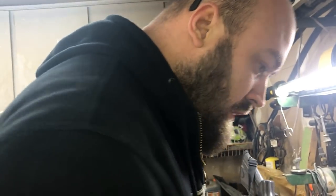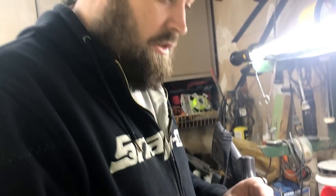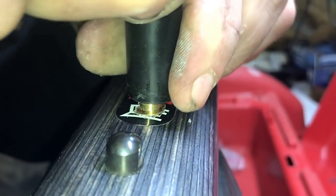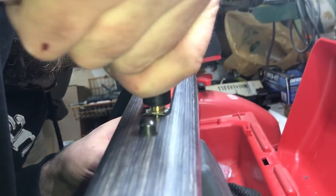Put one of our inserts in — I don't think Loctite will help on the wood so I'm going in dry. Just want to get it as close as you can to straight. It'll kind of straighten itself up as it goes, but keep some nice pressure on it when you first get it started so it doesn't try to splinter the wood. Give it a nice push as you twist it in.